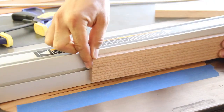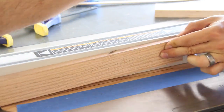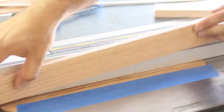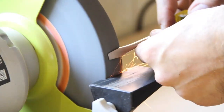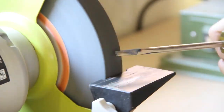Some pieces require a stop dado so I marked out lines where the saw blade crosses the plane of the top. I transferred where all the dados needed to stop and start onto each board. Before making the first pass I lined up the dado with the edge of the blade. Each board is plunged down and then cut but only between the two lines marked on the fence. This ensures the cut will leave room to chisel out the corners. Here you can see the kerf cuts end right at the line.